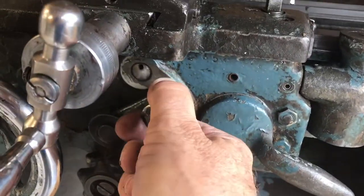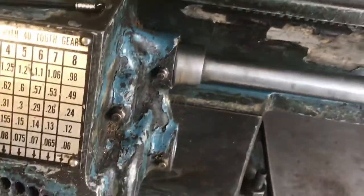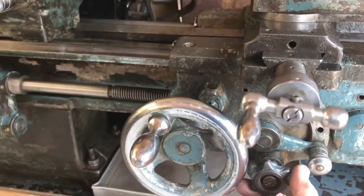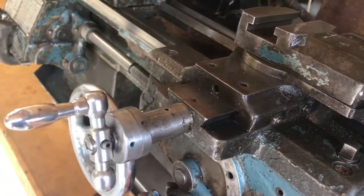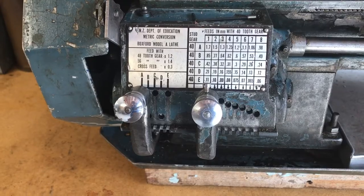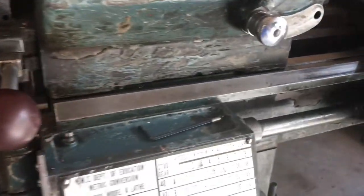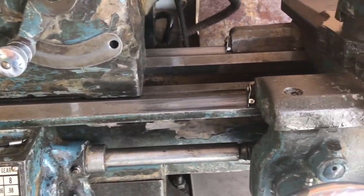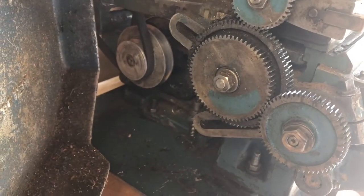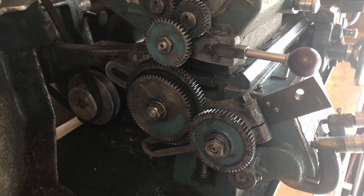Alternatively, you can move the selector gear to the bottom position to get power feed on the cross slide. When we turn the clutch back on, the cross slide automatically moves across — you can actually see the handle turning and the movement since it's going so fast. With the lead screw set to the fastest possible position with this gear train it does half a centimetre per turn. That seems to be the longest pitch available, although altering the gear train could speed up the lead screw further — useful for making an Archimedean screw which requires a really long pitch.